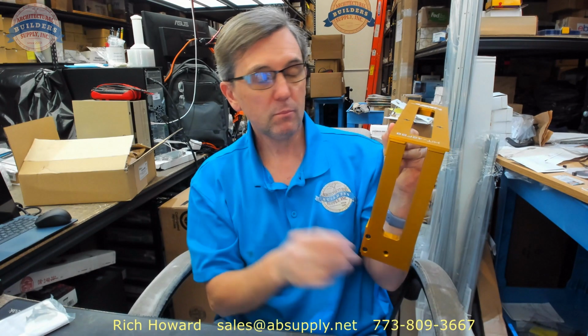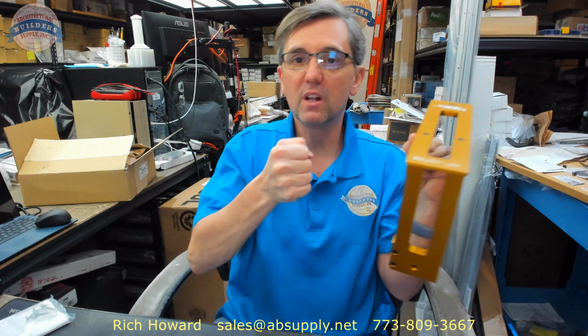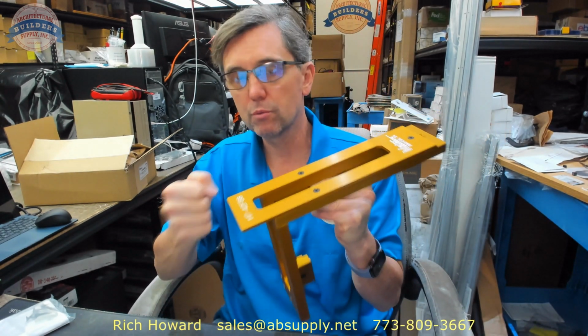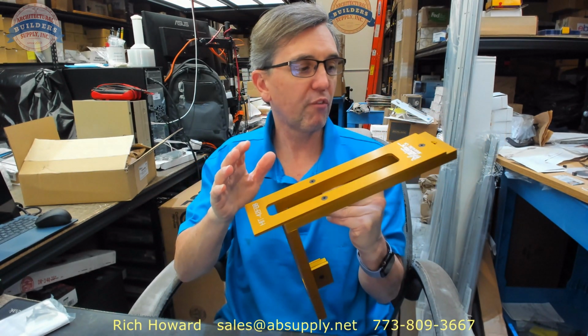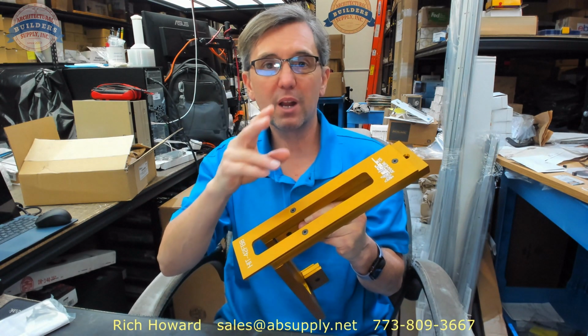I've never tried it with just 2 drywall screws, and I don't know that I would be really interested in trying, for 2 reasons. You're using a plunge router. You're removing a lot of material. You could bump into that template as you're running the router a bit more forcefully than what a drywall screw would tolerate.